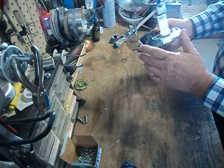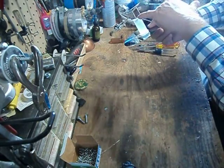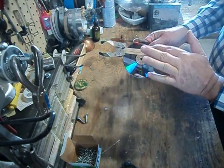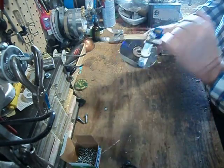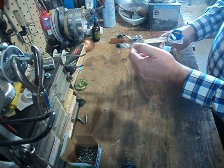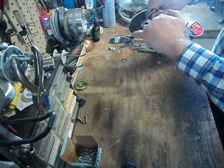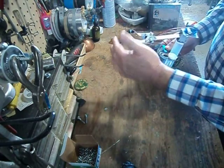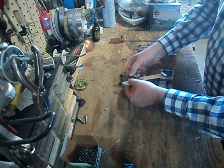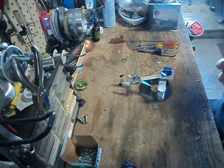Let's take a look at our assembly: the CD, the cap, the pill jar, inverted pill jar, the upright, the servo plate mounted with a servo and roughly in the center with some double-sided tape. And our gripper assembly, our small three millimeter nut and bolt there, nut and bolt here, and then our small spacers in here and here. We top it off with these green ends. At the time the kits come out, they may or may not have those green ends — we may come up with a little friction tape or something else to put on the end.